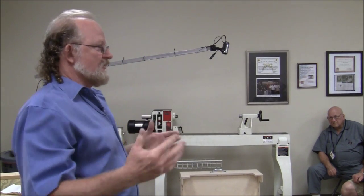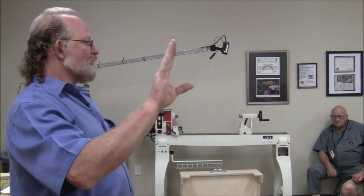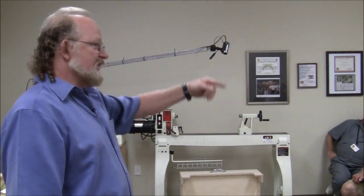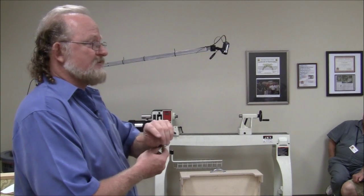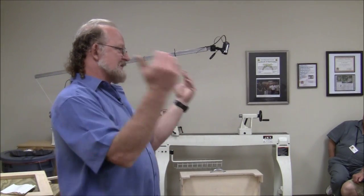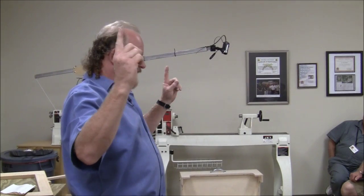Another easier way is just make a molding up, hold it off the wall, put a shim behind it so it won't flatten out, and caulk that joint between the sheetrock and the molding. That's not objectionable to me, but to some customers — especially the house I was on — that wasn't going to do because they were plastered walls. Everything had to go back tight. So you had to fit your head piece down into your trim legs.